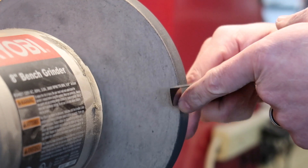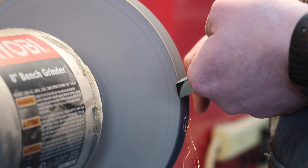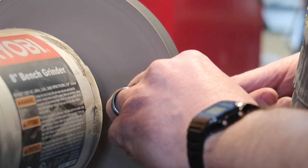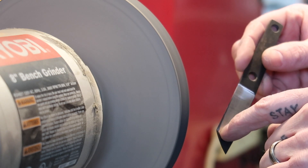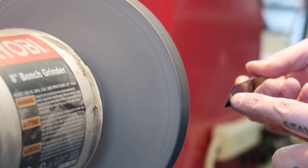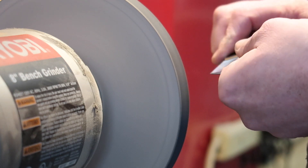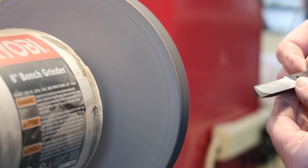Using the telephoto lens you can see a little browning and discoloration — yes, we've changed the secondary bevel to a blue color, and that's a bad thing. We got a nice hot spot right there. This was probably about twenty-thousandths of an inch before grinding and we're almost at the cutting edge. Again, trying to demonstrate this: we've basically wrecked this steel's temper. There's a lot of heat going on — we ruined it.